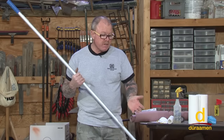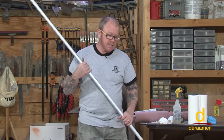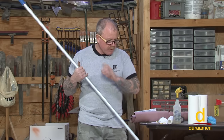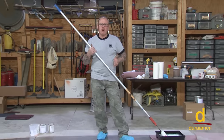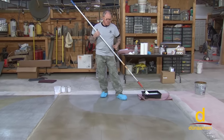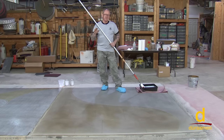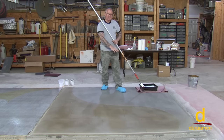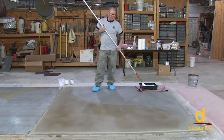We're on our PARAM 5500 self-leveling overlay cement panel and we're about ready to seal it with E32 water-based epoxy. Just a quick recap: on this side the light gray is the Pellucid dye, and on that side is AquaColor — we mixed the AquaColor with water. If you start to seal over the PARAM 5500 you need to be careful because you could get some roller lines due to porosity. The Pellucid dye has a carrier that locks it in so you don't have issues with roller lines, and on the AquaColor we pre-sealed it with AO3 — just a really light coat of water-based acrylic.